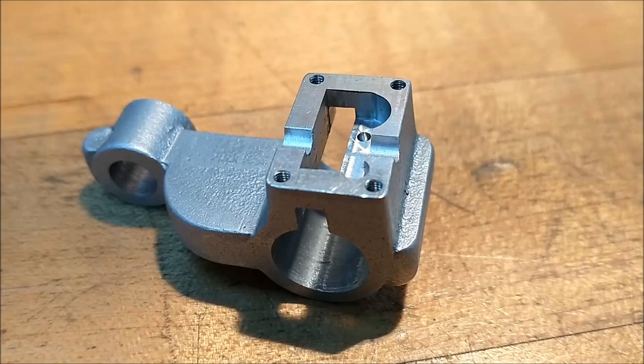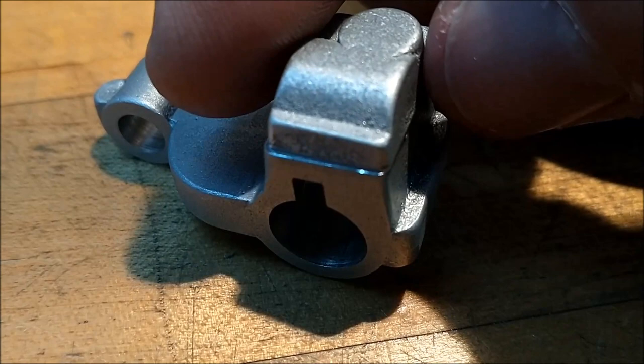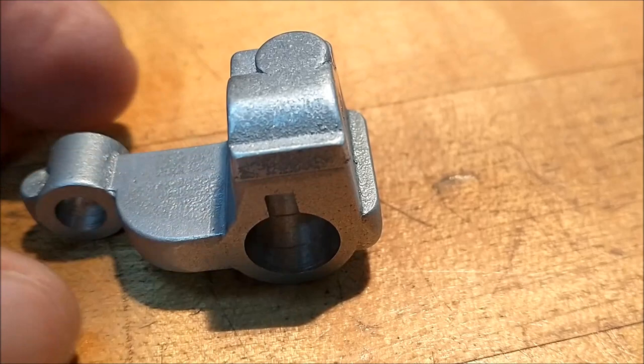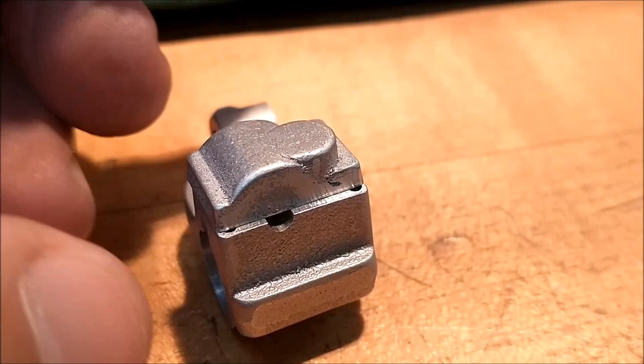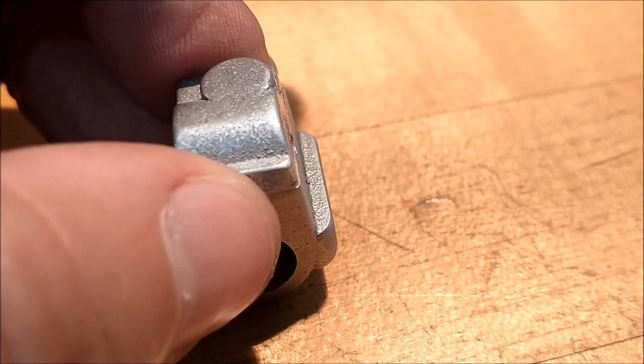One of the components required to complete this particular subassembly is the cap that goes on the knee. As such, in order to transfer the features in the knee into the cap, the first thing I'm going to do is put the mounting holes in the cap so I can mount it. From that point on, I will probably put the knee back in the machine, pick up the features that I need to translate, secure the cap, and translate the features in place, assembled.